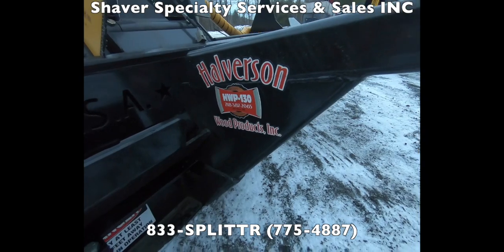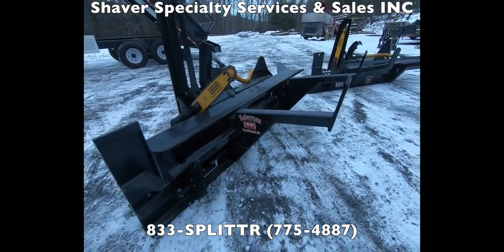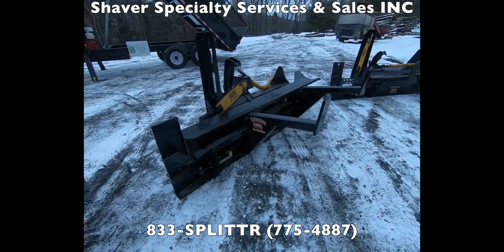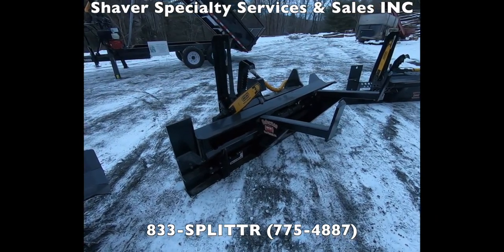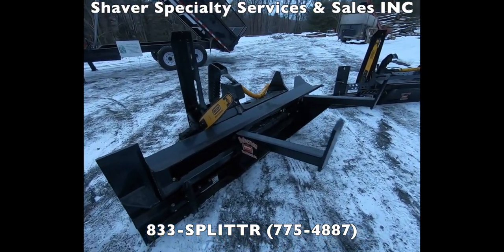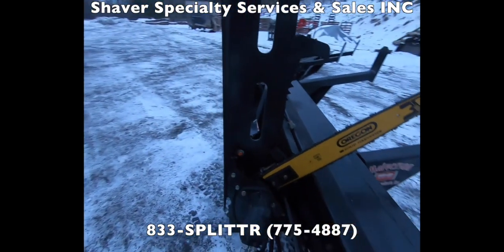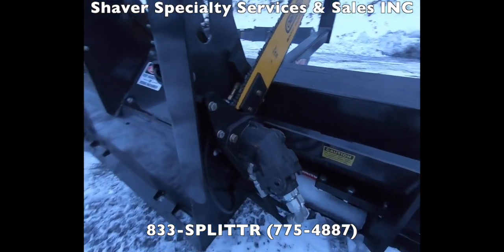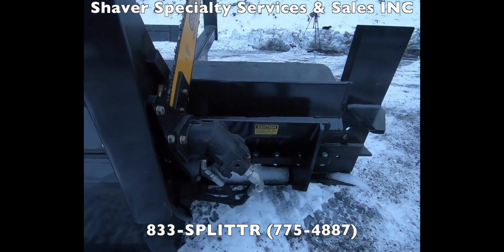There's the 130 logo. It's the same basic body and frame. The metal's a little bit different. It's a little bit thinner in some spots. I think it weighs about 1,200 pounds, where the 140 weighs about 1,600 pounds. One of the noticeable differences between them are the saw motor, the grabber arm, and the internal splitting cylinder is a little bit different. So it's still a bent axis type of motor, but it is not a Parker saw motor.